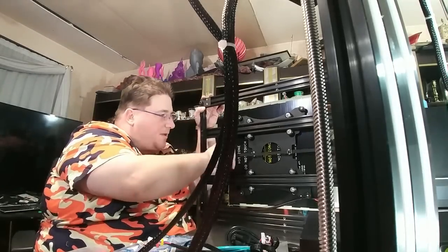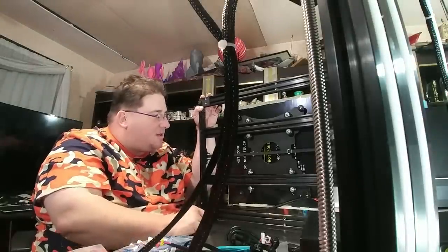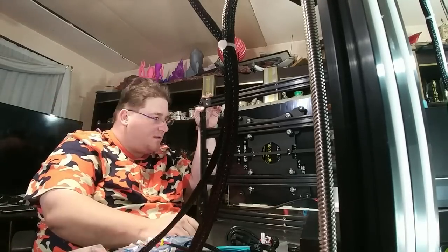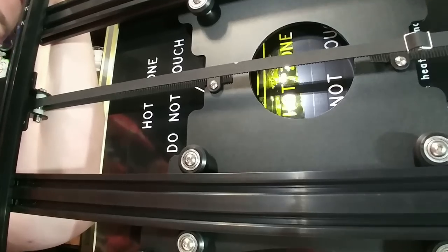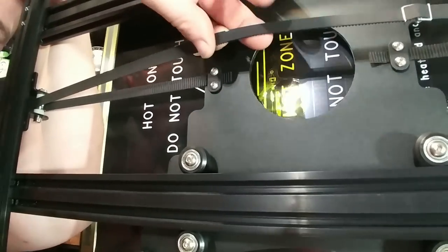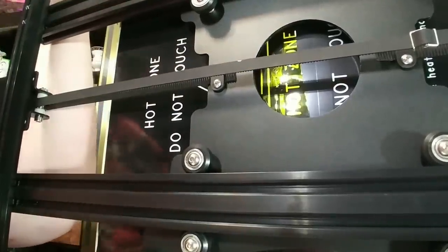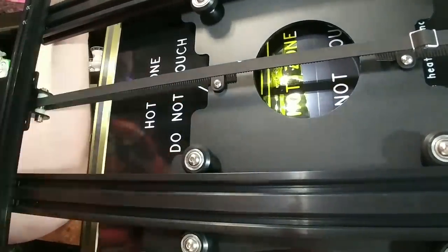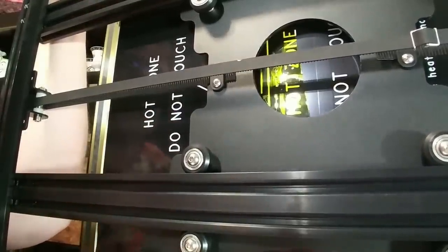There's a big thick heavy-duty belt — that's definitely not a GT2. I like the way it's tensioned with pinch plates: instead of a rod sticking out with a belt wrapped around it, a pinch plate bolts into the Y carriage and grabs the belt to tension it. There's also a little spring dampener on there — I've heard that's not good for ringing, so I might remove it and re-tension the belts, but I'll use it as-is first. The knobs look like CR10-style knobs.